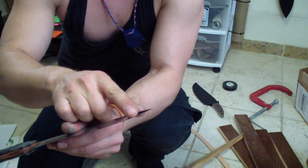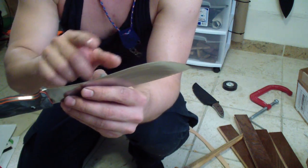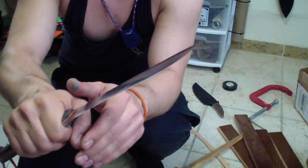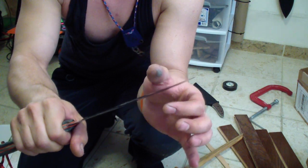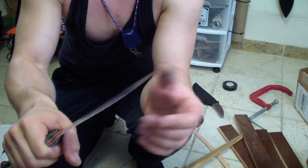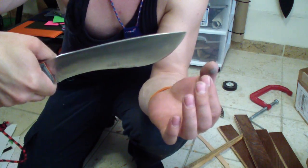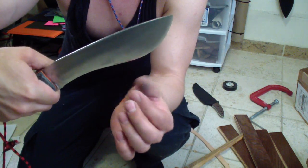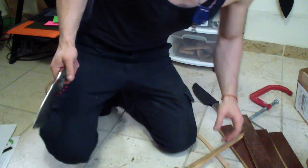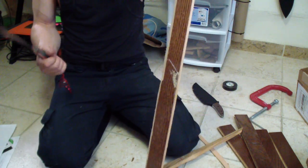And what I did is, the end belly, where you chop, is rounded off more than this. So this is good for whittling. It's a sharper, leaner edge than here. Just the very edge itself. The grind itself is the same, because you grind the geometry of the blade in the same way, but the angles of the actual edge are the tiniest bit different. Again, learn from other knife makers like Kylie.